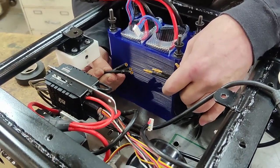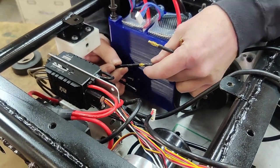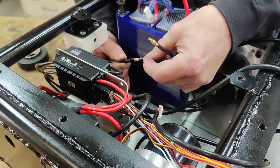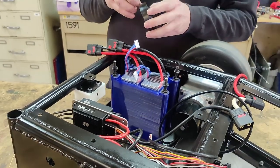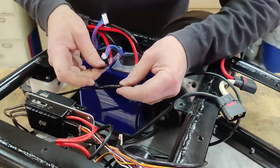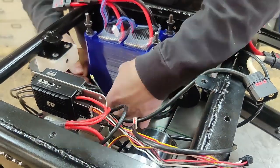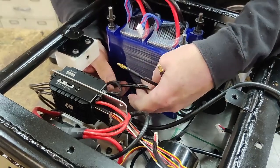The output wires on this speed controller — there are three of them that go to the motors, for the various different phases. These are literally just push fits, which also means under big hits they can separate. So you need to find some way to make sure that those don't come apart. You can use shrink wrap, you can use shoe goo, something like that — at the very least you should use tape. Tape is easy because it makes it easy to pull apart later if you have to change the speed controller, but you need to find some way to mechanically lock those together. Don't just rely on the push fit to hold them together.